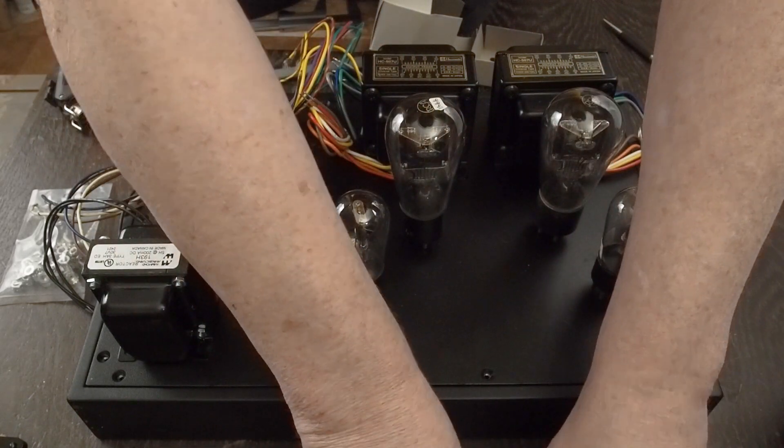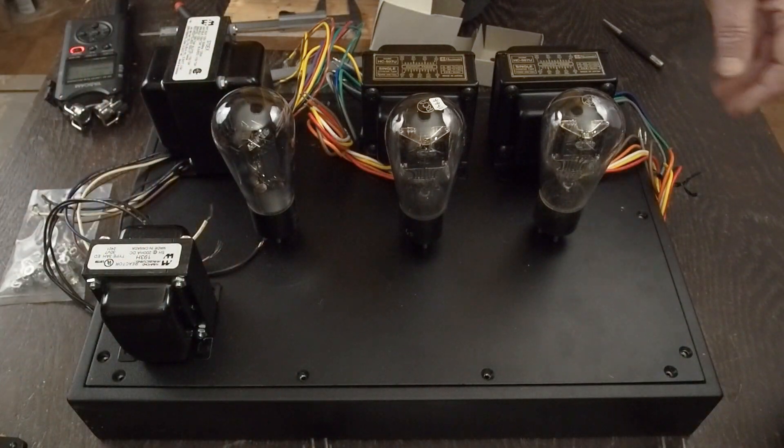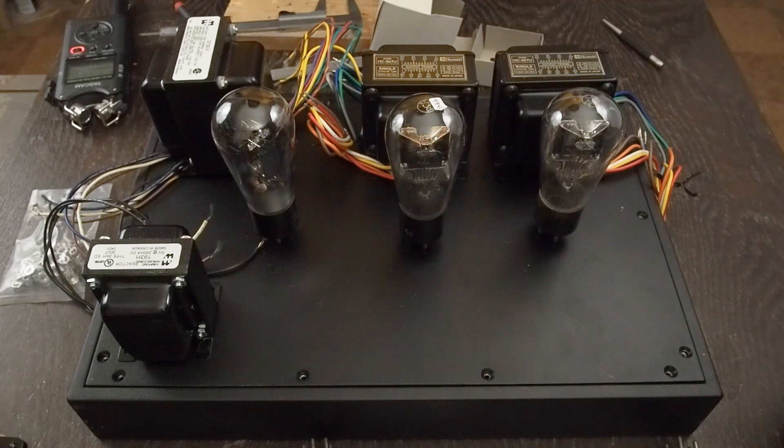I think there's room right there for the voltmeter, though I'm probably not going to put it in until I'm completely done with the amp and know it's going to work. If I don't need the two 56 tubes then things can be shifted over a little bit. I might even try to put this on the front. I haven't decided yet — might also try to find a way to put a really soft orange illumination on the meter that matches the glow of the tubes. So I think this layout is going to work. I'm going to go off camera and mark all these spots for the iron, then come back and show you how I finish up marking and all that.